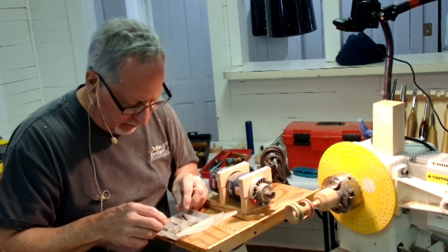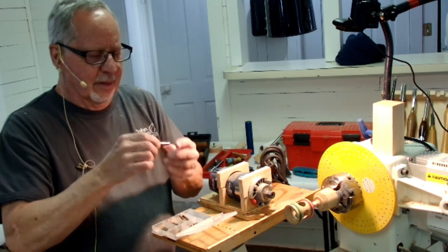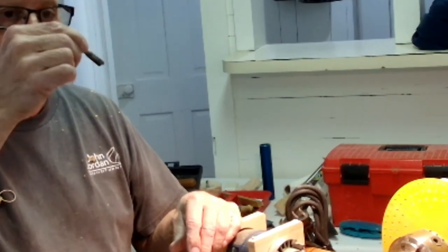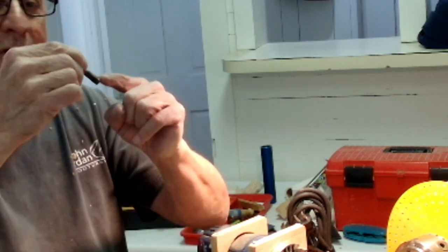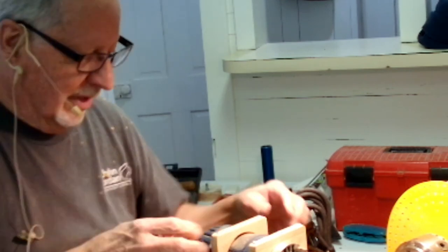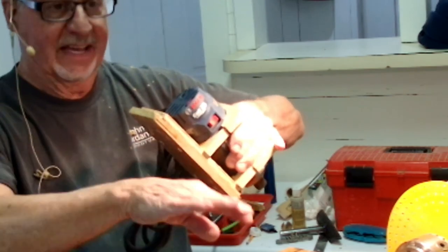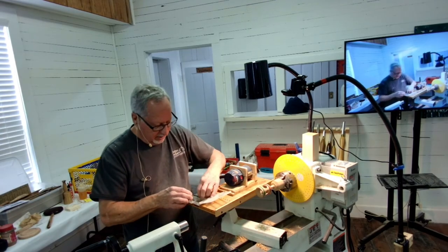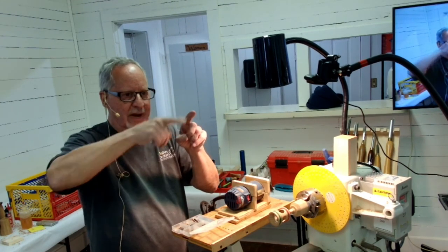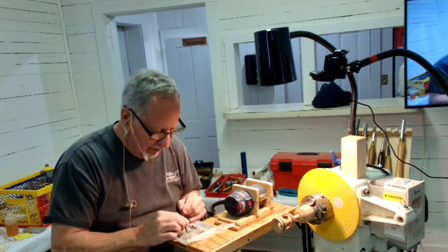So then I came up with the idea one day, and sure enough, I don't have it in here. That's okay, it's close enough. I figured out that if I take a straight cutting router bit, and I mount it 45 degrees, it cuts with the corner. The corner is moving very rapidly. I get a very clean cut. So I got a jig, my router sits like that, so I can do that kind of cut with it. It also changes the look. If you have a round cutter in there, it'll change from being a smooth round cove to kind of a lopsided cove, which is kind of cool. So it's just fun playing with both alternatives.